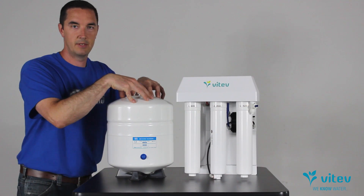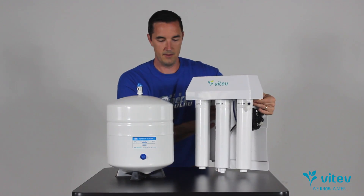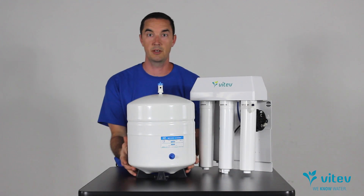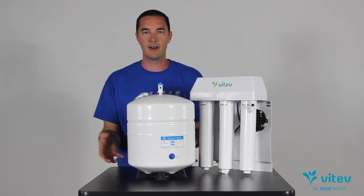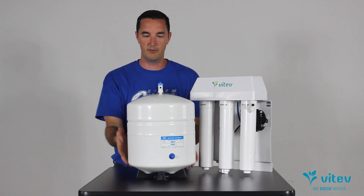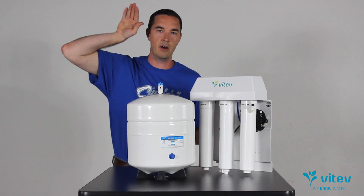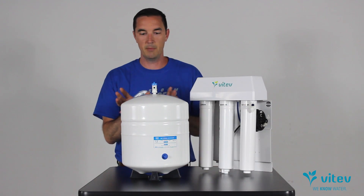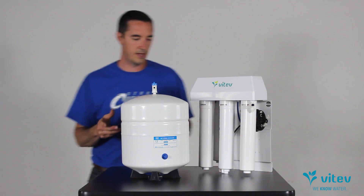For most ROs, you're going to start with the tank because that's the furthest point away from your supply line, and there are three things that can go wrong with the tank. With the tank, a couple of things you have to understand first: this is pressurized — it's called a pressurized external storage tank. Inside the tank there is a bladder, like a balloon, and that balloon has five to eight PSI of pressure on it. We need that because as the tank fills up with water, you've got to have enough pressure inside to push the water up and out to your faucet. If that pressure gets messed up — either from the factory or something weird happens — the pressure can change and it needs to be corrected.